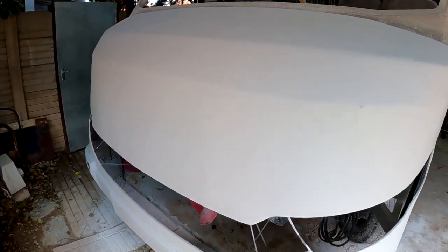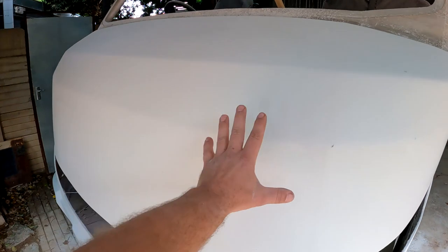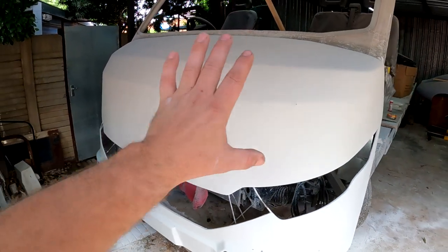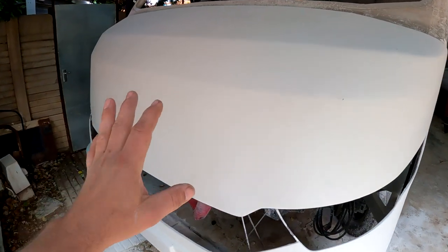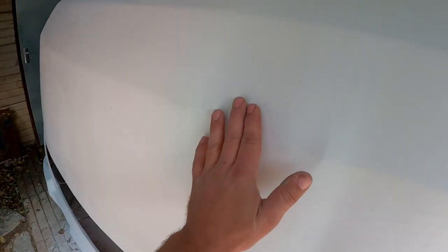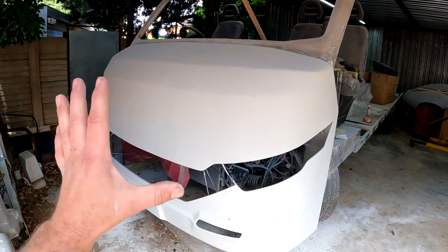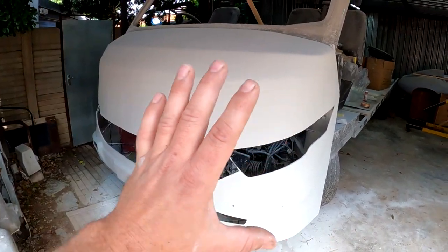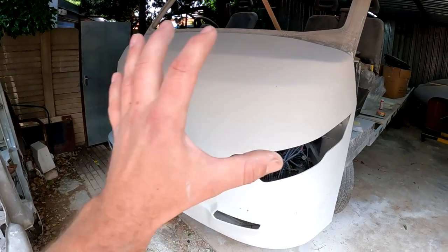Now guys, the only disadvantage when using this PVA and filler when I was making this plug is that it is heavy and it is not very strong, so my work is starting to show a little bit of cracks, and I feel that there might be a joke in there somewhere. And that is why I have now decided that this is how far I'm going to be going as far as finishing it off, and now I can start preparing it to take a mold.